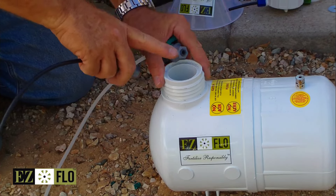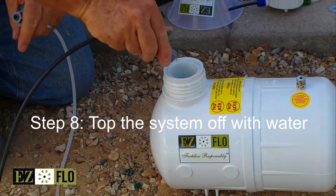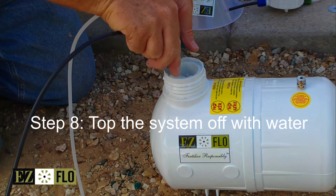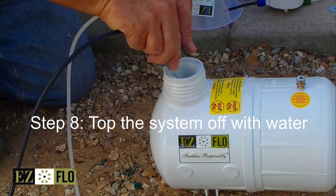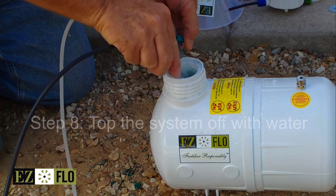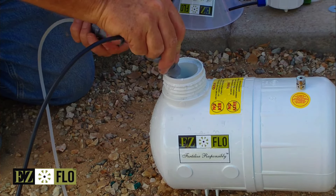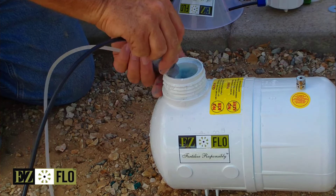Now that the system is pressurized, we come to filling the tank. The water soluble is already in the tank. We have water at our lines right now and we can fill the tank with one or both of the shutoff valves. Open them up and make sure that the tank overflows — you want to eliminate all air from the tank. As you get closer there might be some foam, so make sure that you fill the tank to capacity to eliminate air.